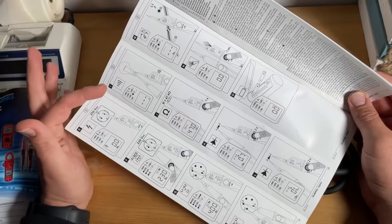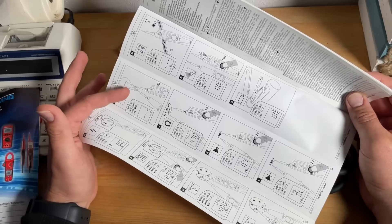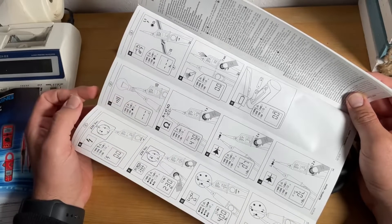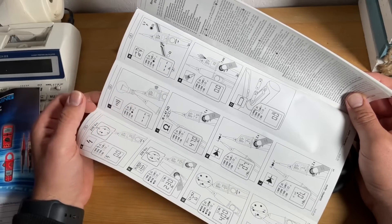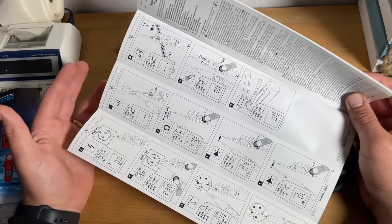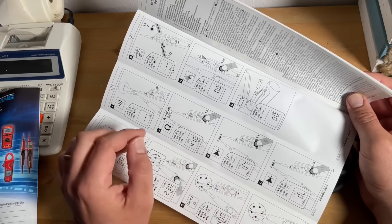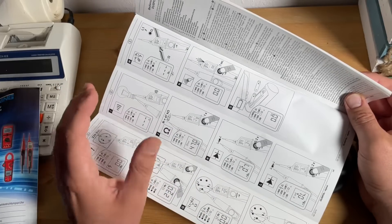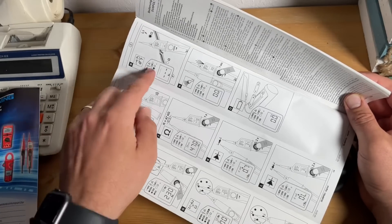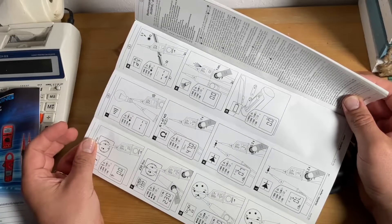We can make a voltage test lower than 6 volt — that means a low voltage function. We can also make an overload indication: if the voltage applied to the probe tips is higher than the normal voltage, the OL symbol is shown on the LC display. We can make a load connection with the vibration motor, an external conductor test with phase indication. Continuity test, resistance measurement, diode test — all are possible with this awesome device.